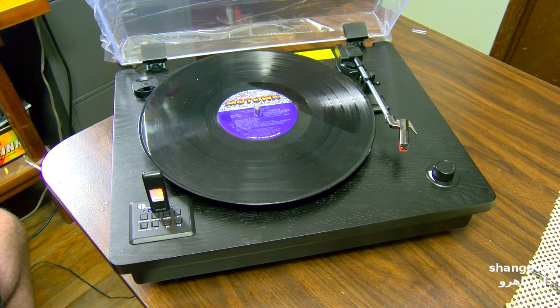It's also reducing the bass as a trick to make something louder that's underpowered. So that's what the loudness control on a lot of stuff is. It increases the bass at a lower level and tapers it off as you increase the volume. That way you can have a lower powered amplifier and it still goes loud before it clips, because it reduces the bass where the majority of the power is consumed.